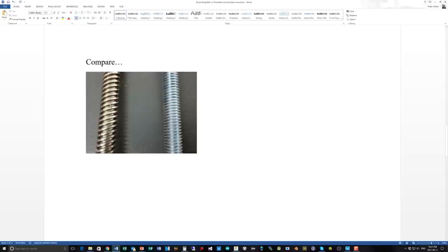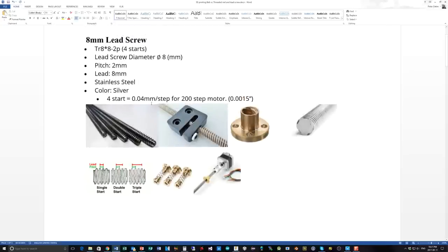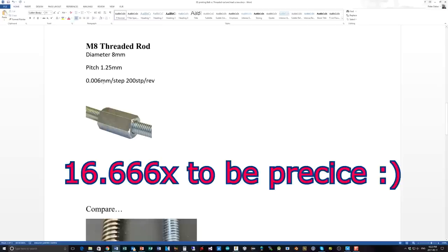There are good reasons to go to a lead screw, even though it's slightly more expensive. The resolution is still more than enough for 3D printing with a 0.4mm nozzle. When you look at a threaded rod, you're basically wasting resolution, because even for the vertical Z axis with 0.2mm or 0.1mm layer heights, you've got almost 20 times more resolution than you actually need. So you're just wasting resolution - you'd be better served by the lead screw's combination of better surface finish, trapezoidal profile, and appropriate travel per revolution.